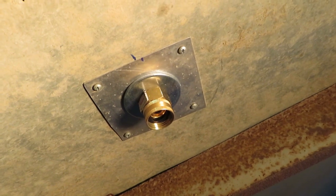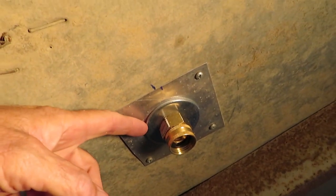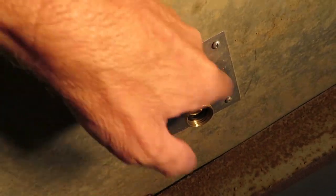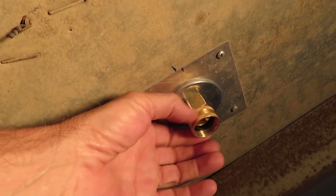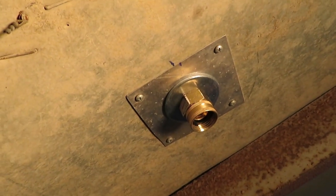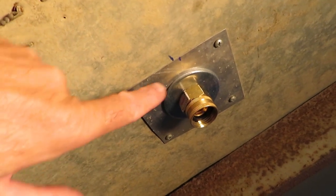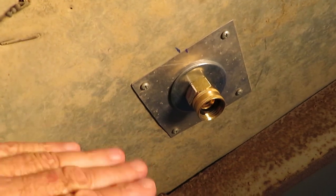Here's the city water inlet installed. I bought a couple of big washers — there's one on the inside of this plate also. I made my hole and used some trim to fasten the whole thing. If I need to get in there I just undo these four screws and the whole thing drops down. This is available at any hardware store — it's a hose connector to iron pipe on the other end, and that hooks up to an IP-PEX compression fitting inside between the floor and the belly pan.